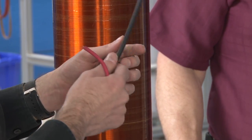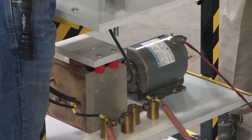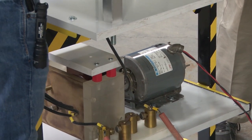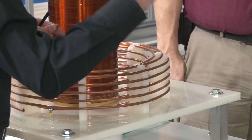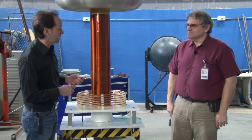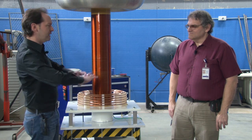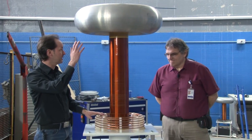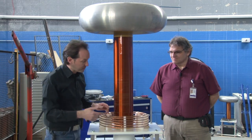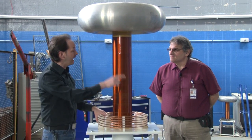This is much thicker cable. In the tank circuit, you want the thickest cables you can possibly get. It's important to have the insulation stand up, but thicker wire is better because the instantaneous current down in here is like 10,000 amps — it's really, really high current, so beefier wire is better. When we do this for big coils, we don't even use wire — we go straight to using pipe. Just by changing out the cables and getting everything shorter and compact from the lash-up prototype stage, there's a huge increase in performance, and all we did was change the wire. Here all we've done is changed the toroid and tuned it appropriately — huge increase in performance. And now we've replaced that one last piece of the cheap stuff, so we get to fire it up again and see how the performance is with a better toroid and that final piece swapped out.